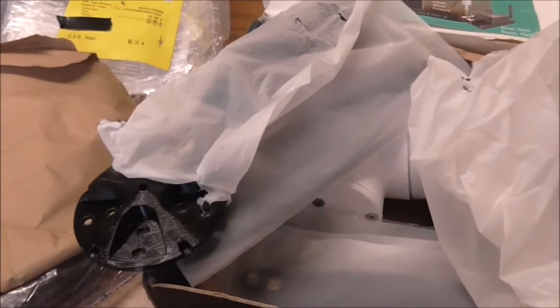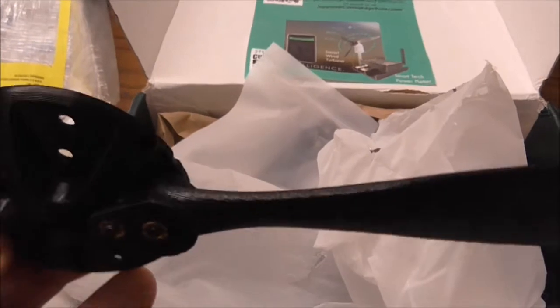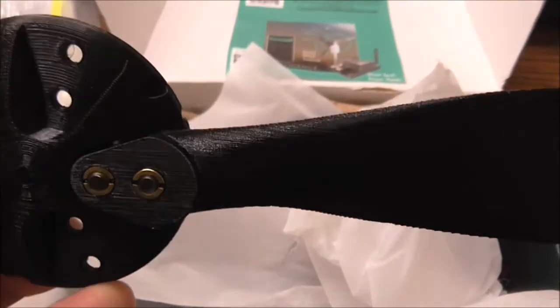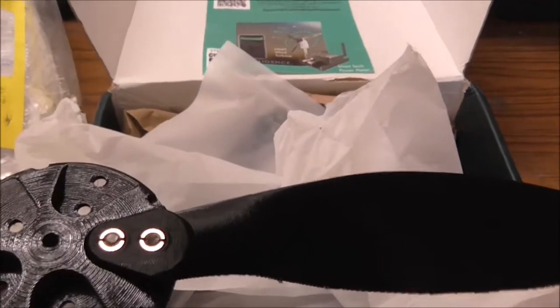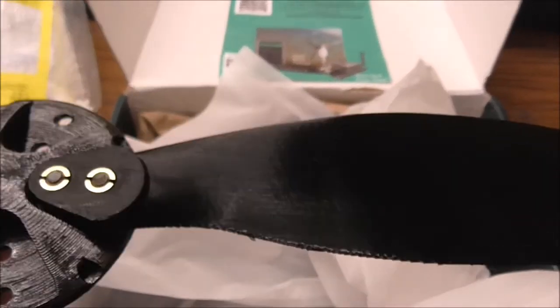Let's see what's inside. This is what you get in the box. I went for the five-bladed 18-inch model — perhaps three blades is better in some conditions, but five blades are supposed to perform better in lower winds, though they're less efficient in high winds where the three-blade version is better. They put one blade on the hub already, and there's an arrow on it showing which way the blade must point into the wind. This is a downwind turbine with no fin.